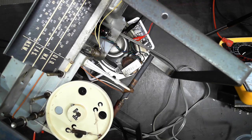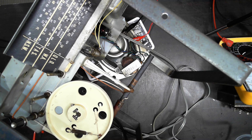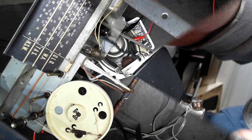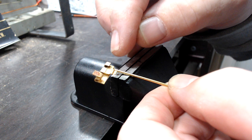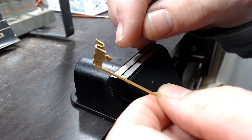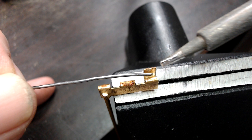The tracking on the dial is perfect — it's spot on the stations, so I don't need to go further. I'll prepare the case and put it to bed. Another issue I found is the cursor off the tuning dial — one is missing its little hook where the string goes, and the other has a big crack and is just barely hanging on. I'm going to try to solder it. I've bent up a bit of brass to sweat under there to make another hook.